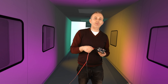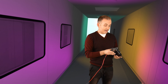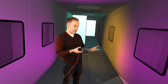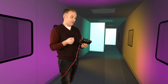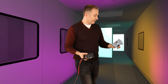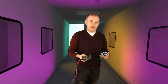The device can also do so-called pre-listening — that means even before you press the record button, the device is already listening and recording for a few seconds. It has the ability to connect to your computer and become an audio interface, with a few multi-track or stereo options explained in the manual. The only downside for me is that the line outputs on the Zoom F6 are consumer line level, and my studio monitors accept professional-level plus 4 dB signal. This consumer level signal can be easily converted — I'm using a Radial Engineering J+4 converter. It's almost half the price of the Zoom F6, but it's an amazing, highly recommended device.